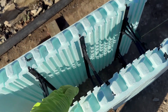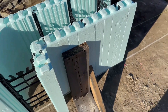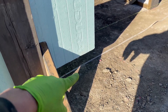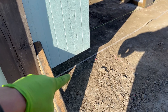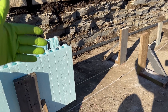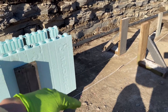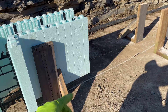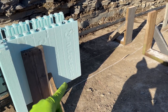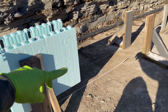I put these exactly 11 and a half inches apart — I put one on, then I'd use a sample piece, usually an eight-footer, and then put the other one on. That way I know they're going to go right back in. Up here it's going to end up being about five to six inches off the rock. So unless we get the perfect mix design — a four-inch slump would be ideal — we were going to drop it down and let it mushroom out, then move on to doing some piers and posts while the concrete truck and pump is here. But it gets a little sketchy if you have the wrong mix. If it's too liquidy, it'll just keep flowing out, you won't be able to stop it, and you're wasting concrete and won't get a chance to fill the wall.